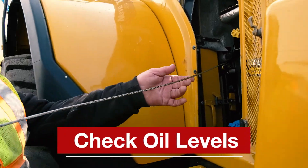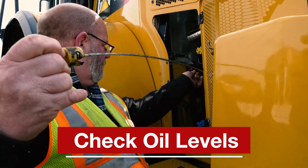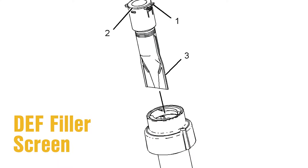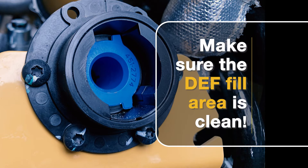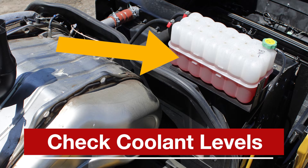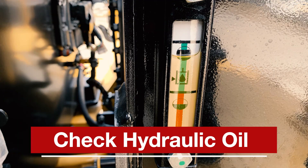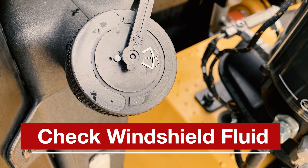Next, you'll need to check your fluid levels. In the rear left side compartment, check the oil level, check your fuel level, and add if necessary. Check your DEF level and clear the filler screen of any debris buildup. DEF fluid is corrosive, so be sure to keep the fill area clean at all times. Check your coolant level — your coolant tank is located under the hood in the rear of the machine. In the front of your machine, there is a sight glass to check your transmission oil levels. Up on top, near the cab door, check your hydraulic fluid level. To the left of that, you can also check your windshield wiper fluid.